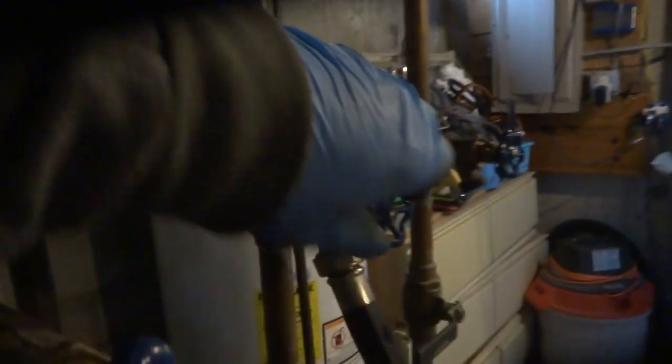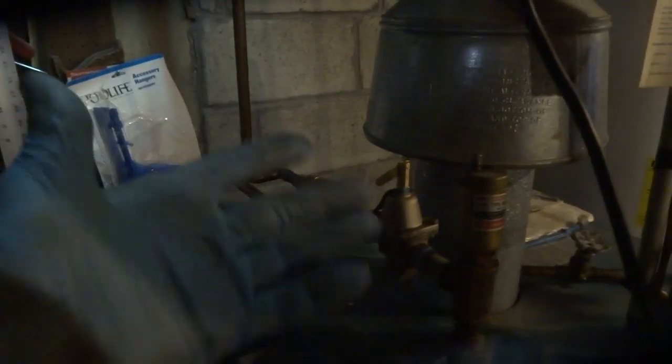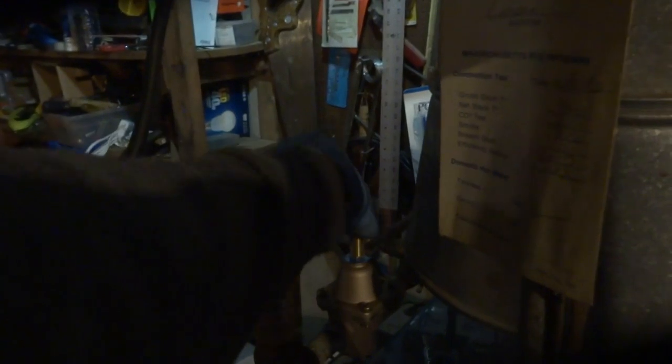Alright, now I'm filling and I'm going to go up through the zones — purge the zones. They've been complaining about air. They would have never got the air out with the old stuff the way it was, so I had to change it. You can hear it pushing through now — that's what we want. We'll be here all day playing around with it the other way. I ain't got time to play games; I got other jobs to do.